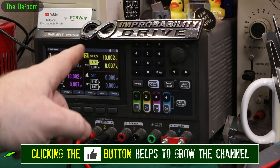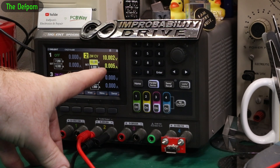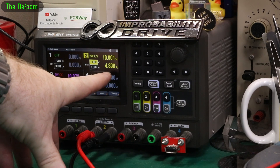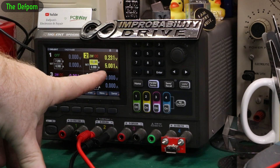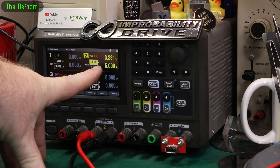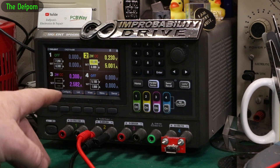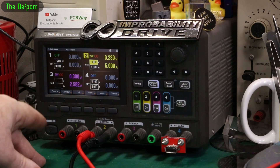Now for the current issue, which I'm going to demonstrate. Before, with a set of 5 amps connected to my electronic load, I'd get 5.3 amps in this setting. I'm going to turn the electronic load on. I've currently got it drawing 4.9 amps with the current limit set to 5 amps. When I wind this up a little more — I'm going to 5.1 amps — you can see we're getting exactly 5 amps here, 5.01 amps. And the balance between the two channels is much closer now: 2.418 amps versus 2.582 amps. They've closed that gap up a lot more and improved the accuracy. It's set to limit at 5 amps and it's actually doing 5 amps — they fixed that.